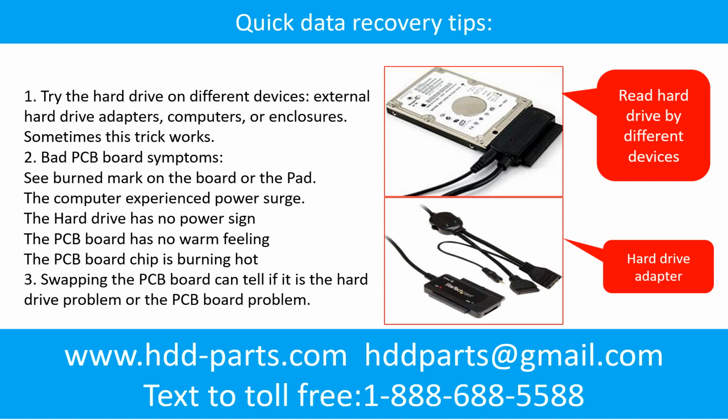There are some simple ways to recover data from a hard drive. One of them is to try to read the hard drive with different devices, like different external hard drive adapters, computers, or enclosures. Because different devices use different ways to read a hard drive, sometimes this trick works. Another way is swapping the hard drive PCB board, which can fix problems caused by the PCB board. There is a cost in swapping the PCB board, but it is way cheaper than sending the hard drive to a data recovery firm.